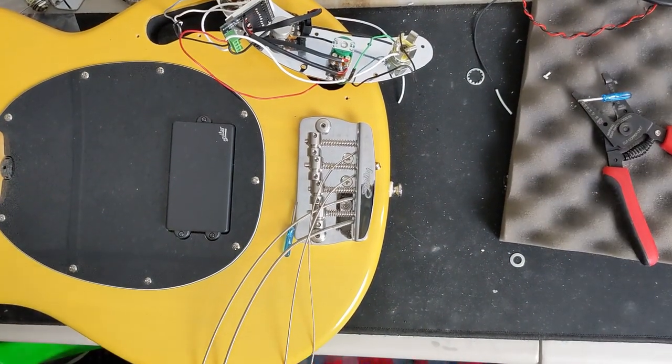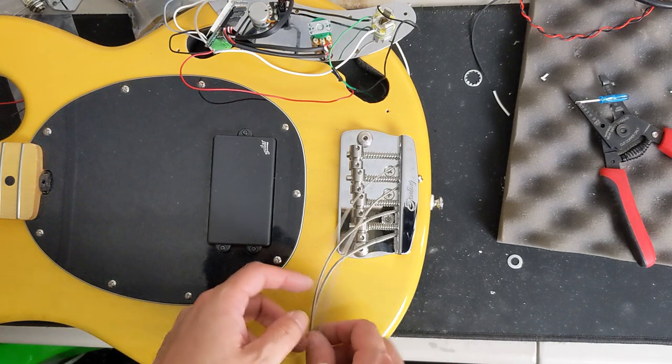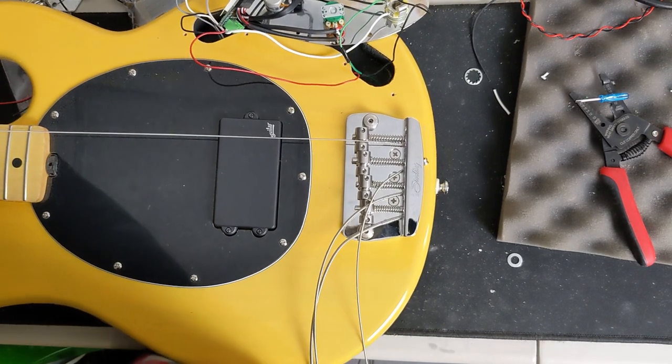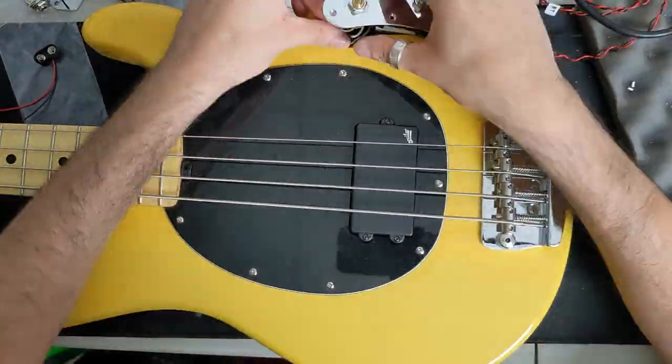Let's see if we get a signal — looks like we have a signal! Let's go ahead and string it back up and try to fit this cable mess inside that cavity. And we're back. This is the Ray 24 with the Aguilar DCB pickup and the Darkglass tone capsule preamp. To fit the Darkglass preamp on this control plate we utilized a stacked potentiometer — it is a Noble concentric pot, which will be linked in the description below. It's a 50K stacked pot with a center detent. It is the perfect solution for what we were trying to do here, and it worked flawlessly. Let me go ahead and show you what this thing sounds like.